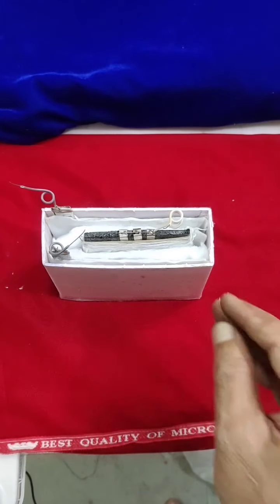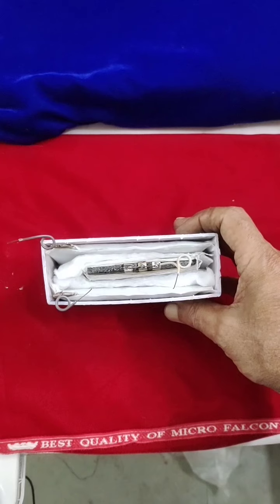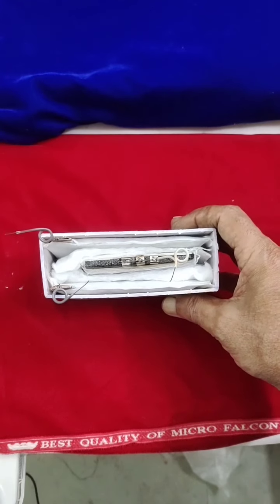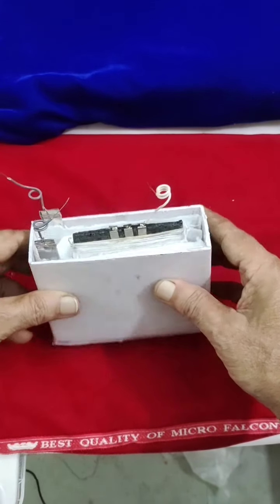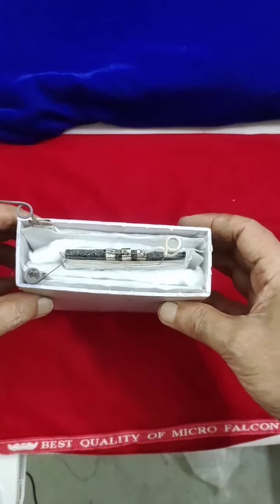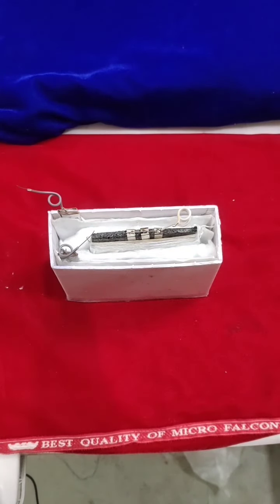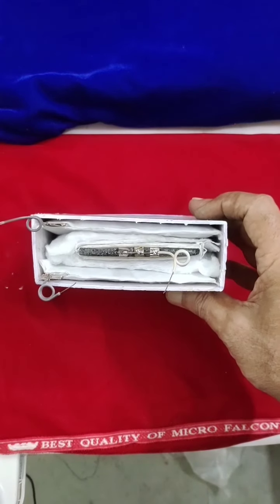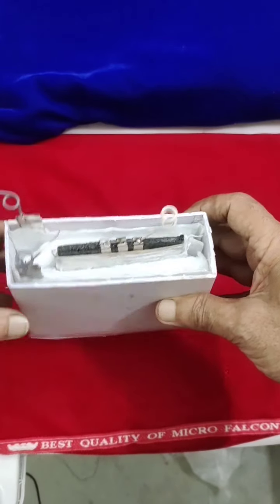I can now fill this with electrolyte. What will be my electrolyte? I am using a combination of aluminum chloride 2 molar, zinc chloride and zinc sulfate, then traces of manganese sulfate. I'll prepare the electrolyte and I'll show you the pouring also, and what volt and current it generates. The modification I've done is I have pasted carbon layers above the aluminum negative electrodes. So I felt that this will reduce the dendrite formation. That is my theme.